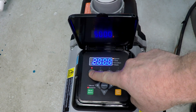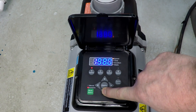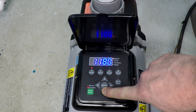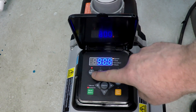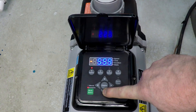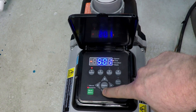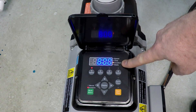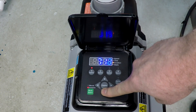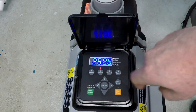With the pump currently stopped, we press Speed 1 and you'll see 'speed' starting to flash, which means we can make our selection. We're going to dial this down to 900 RPM. Press Speed 1 again and it asks for the time of day I want this 24-hour schedule to start — I'll choose 5 AM. Press Speed 1 again and 'duration' starts flashing, asking how many hours. I want seven hours. Press Speed 1 again and Speed 1 is now programmed.